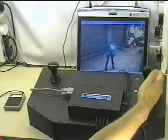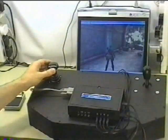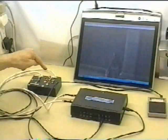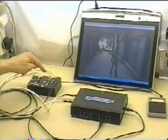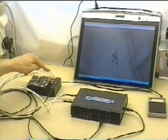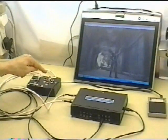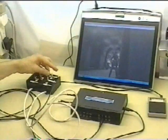For example, a commercial industrial joystick from a wheelchair controller can be connected almost directly. This configuration allows the use of ordinary switches directly across the connections of the analog joystick port. The electrical design of the port prevents any damage to itself in the event of a short circuit between high and low reference outputs.